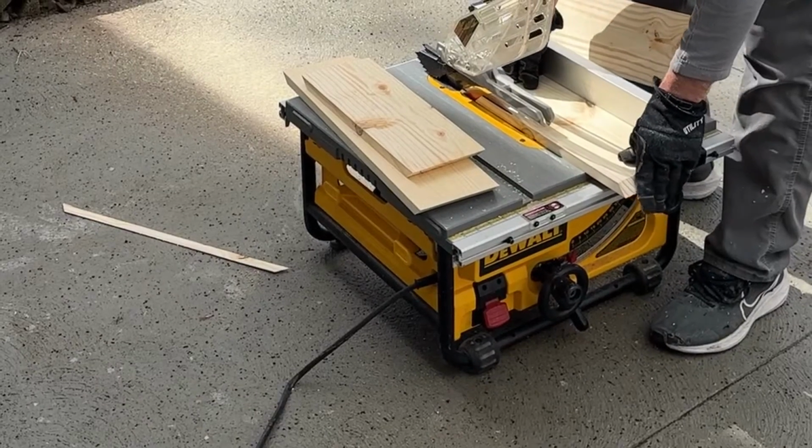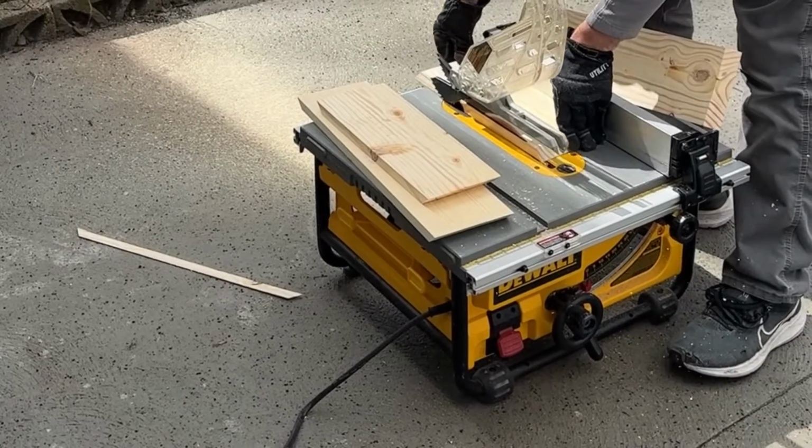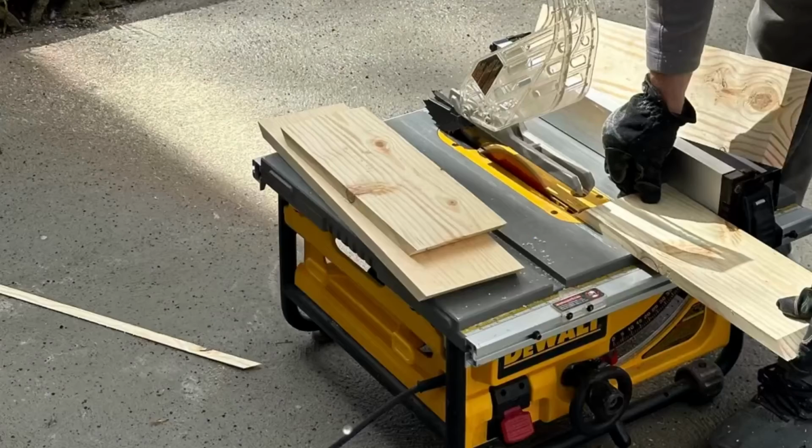The boards we're using to make the frame are 5 5/8 inches deep. For our wall, that's just a little bit too deep. So if yours are too long too, take the boards to the table saw and cut them down so that they're the perfect depth. So now that we have all the wood cut, we just need to attach it to make the frame, or the little mini bookcase that will go inside to make the inside of our medicine cabinet.